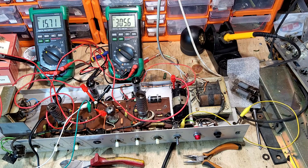People push tubes much higher than that, and they're not far over. Our screen voltage is 269 volts - 19 volts over spec - and I think I'll leave that. The plate is 305 volts - 55 volts over. One more thing I'm going to do is put an HT fuse in this amp, since these don't have one. Seeing as we're pushing these valves a little harder, an HT fuse makes sense. So the 6P18P tubes are running in the WEM Dominator.